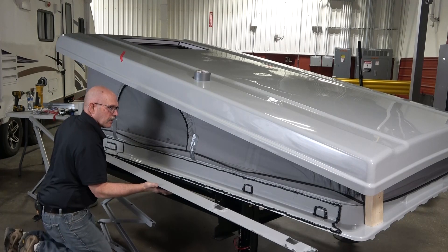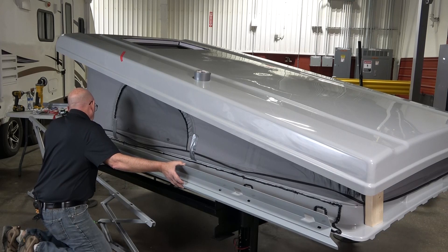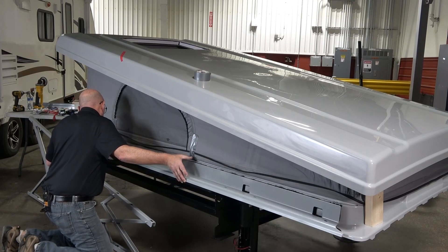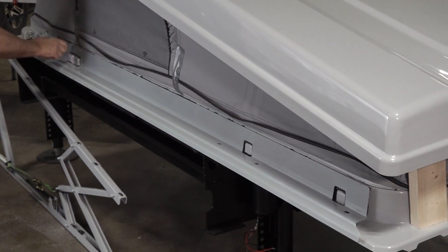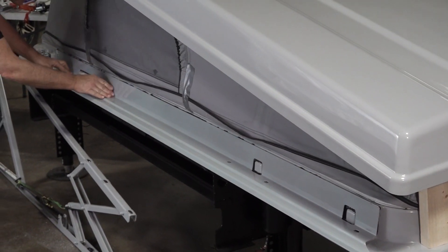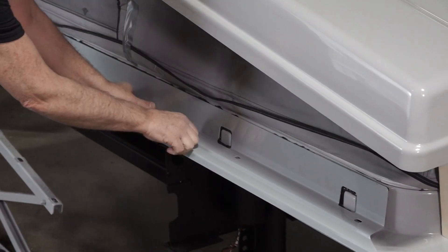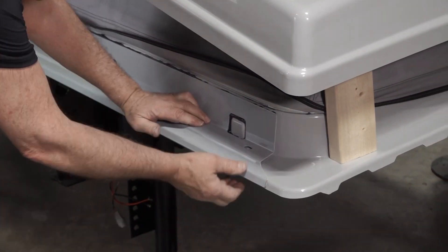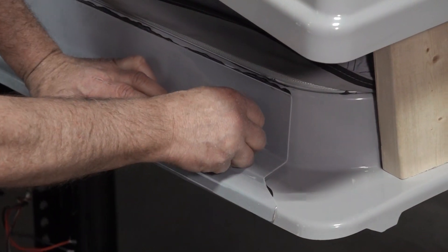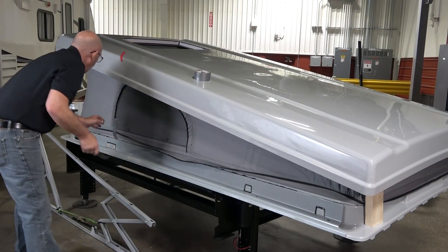Now we can install the cover piece. Install the cover piece over the frame aligning all contours and bolt holes with the holes in the cover, starting with the middle bottom bolt hole. Push firmly on the cover. Adhesive will ooze slightly out of the cutouts and at the top. Remove tape from fabric and gently lower the skirting over the sealant.